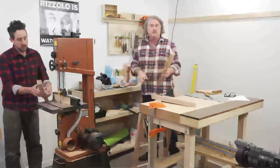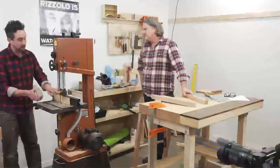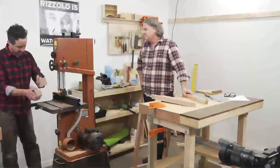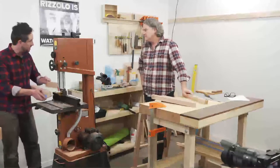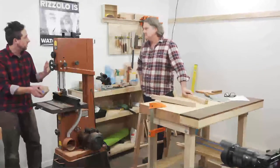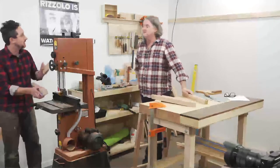So, yeah. Okay. Now I'm about to cut the mortise. Now, I've had to put in a 3 mil packer, and what that does is means that the blade is not cutting where it was, but 3 mils over, which is about 1.5 mil on the opposite side of the line. Oh, okay. So that gives me that clearance.